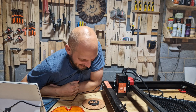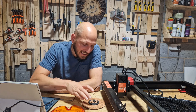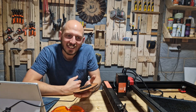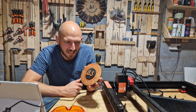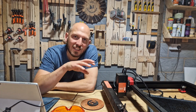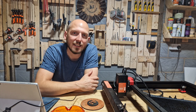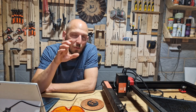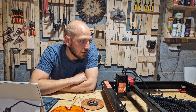Now this was just an experiment — just me playing with the laser, which is pretty much all I've done since I got this thing. But that is a proof of concept. I wanted to create something 3D with tiers and that just made it so easy. I just let it run for nine and a half minutes, then put a bit of Danish oil and spray painted it black, a bit of CA glue to stick things together, and you get this cool 3D tiered effect. This application has me thinking about making signs and art for the house. And that is where I get excited about this laser. It's an incredibly powerful laser — the most powerful 22 watt laser you can buy — but for me the real key is in the accuracy. Things are so accurate with this laser and it just continues to amaze me.